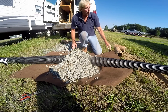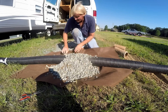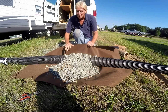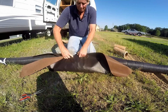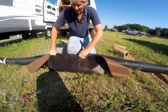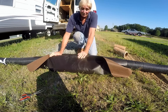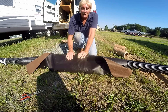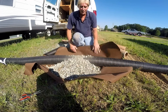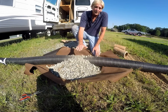So if you're going to wrap this — your trench is here, you lay out your fabric, fill it up, pin it — there's your footer tile encased in gravel and fabric. Remember, the fabric really slows down the water, and once it gets inside it doesn't move easily. It can't really escape. I think the gravel system without the fabric works a lot better.